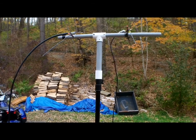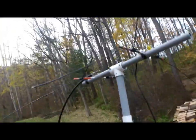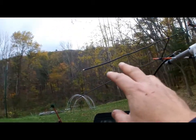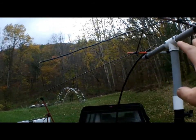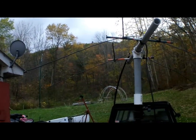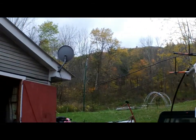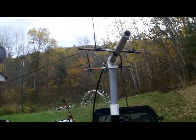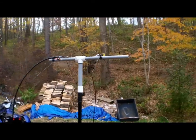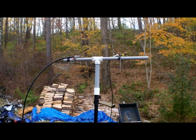One interesting thing I noticed — I'm not going to demo it now because my battery just went dead in the radio — but this element as an inverted V, when I flattened them completely horizontal, it seemed like I had a stronger RF field, and the angle of radiation did change. So I'm going to have to mess with that a little bit. Hope you enjoyed it. More steps to the build coming — it's going to be an ongoing process. Thanks for watching, 73, hope to hear you on the bands. The Maniac.